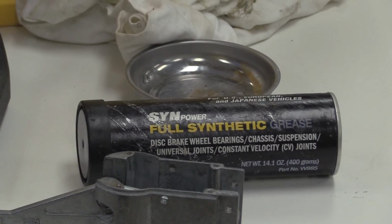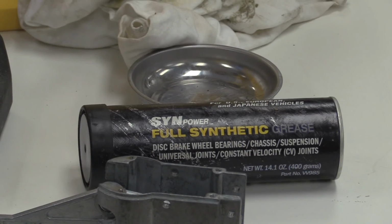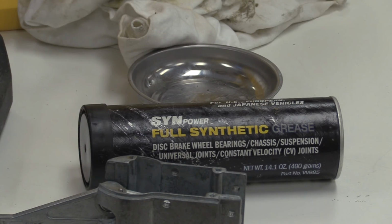In other words, expose each one of the needle bearings, inspect the sleeves, because the sleeves will tell you what the wear pattern is. If you clean all the grease off of the sleeve and examine it carefully, and there's just a little bit of shine to it and no imprinting or denting, that's the thing to look for in those. Then all you need to do is refresh the lubricant a little bit and put it back together.